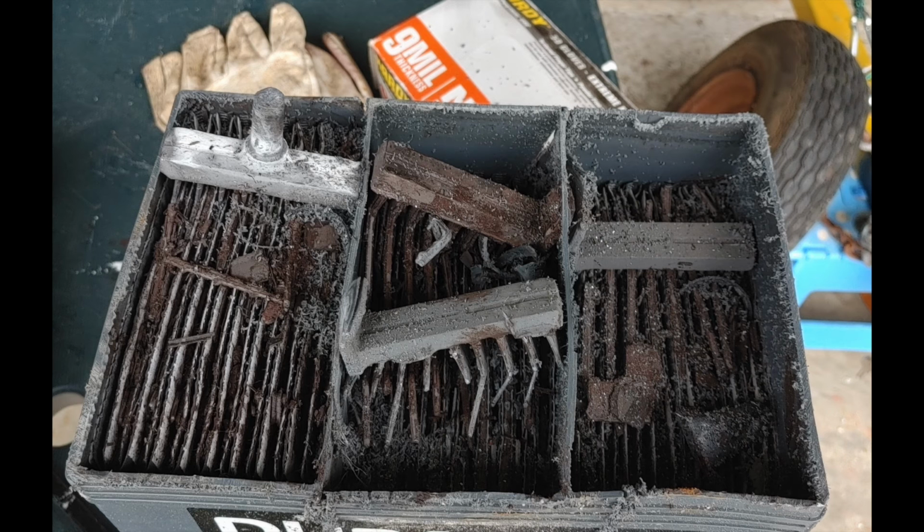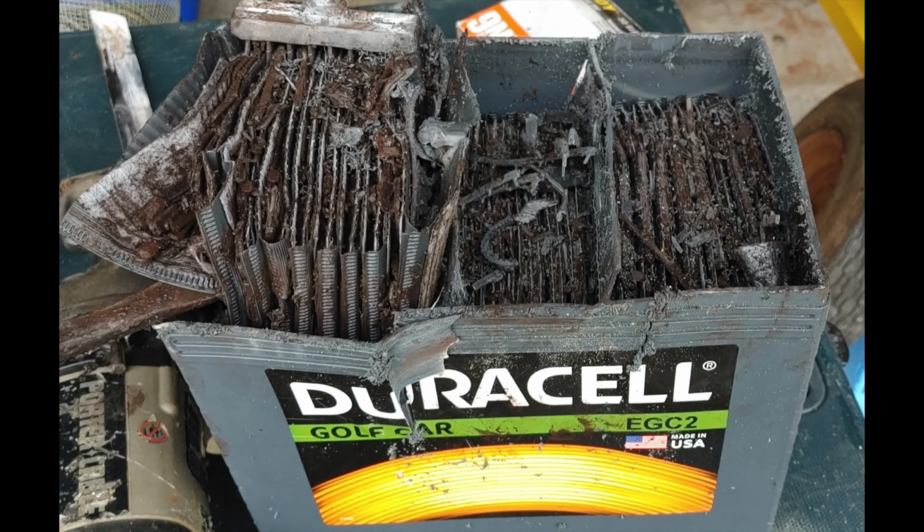The top of the battery is on the left side, and you can see inside the battery at that point. And here is the inside of the battery from the top view. And to be honest with you, you see those, there's like 4 of them there, the big connecting bars. Those are pretty much solid lead. And below those, all of the rows are sheets of plastic, and inside the plastic is a little bit more lead, and we'll talk about that later. So I began pulling all of those out and putting them into my mixture to neutralize the acid.